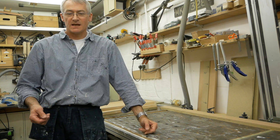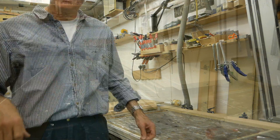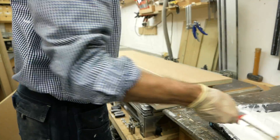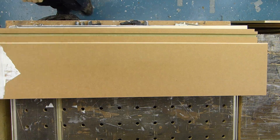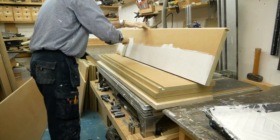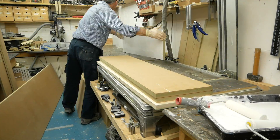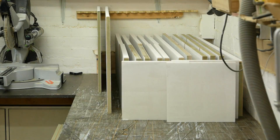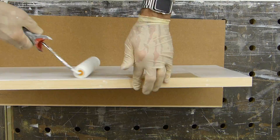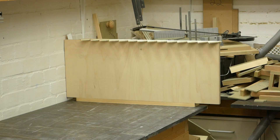Time to let the dust settle, then maybe we can do a bit of painting today. We follow a familiar and well-worn path for the painting: a water-based acrylic primer undercoat followed by two coats of water-based acrylic eggshell, all applied with a dense foam roller and left to dry thoroughly. Nice drying racks, by the way.